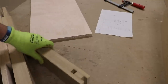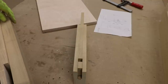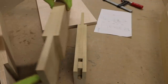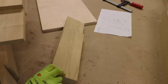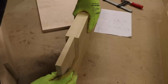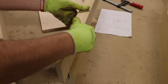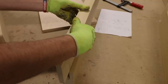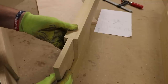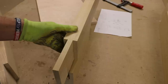So now let's check tenon position. Just stab one small hole, doesn't have to go right full depth, just enough to get it 10mm deep, set into the timber. Make sure you mark the face on the test piece. Then we could just overlay one of the tenon joints so it's flush with that piece of timber. And we put that right up against the shoulder there, where the shoulder meets the tenon.